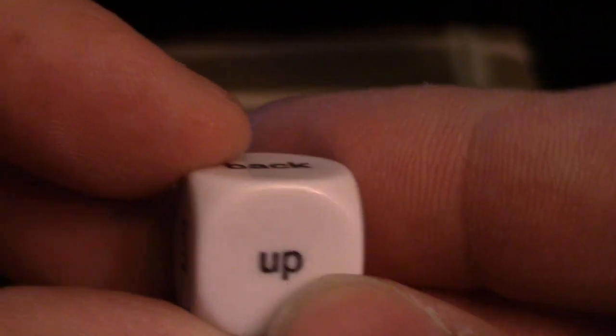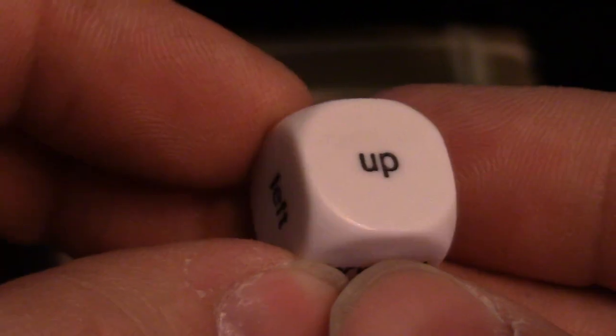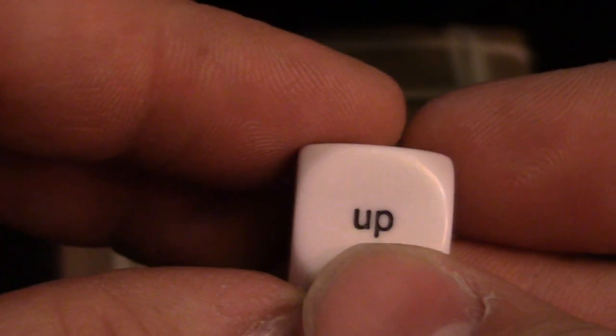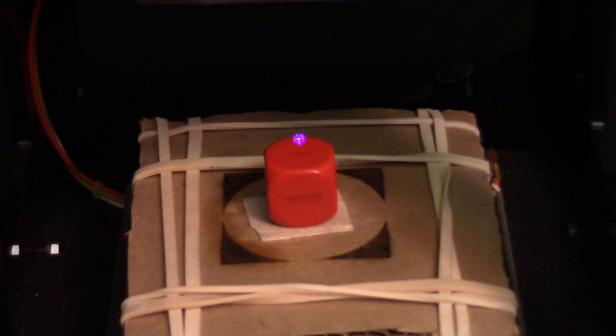This means we have to go to the next part of the experiment, which is where I thought we'd end up anyway — using a primer on the dice. We're going to paint it and see how well the laser etches onto the actual primer. Back in a second. Okay, we're back. I used a paint-primer combination on the dice — it's a Rust-Oleum glossy red — and now we're going to run the laser at 50 power, the same we used for the Red Dead coin, to see if there's an actual etch through the paint.